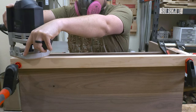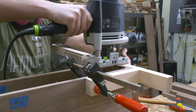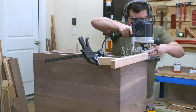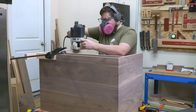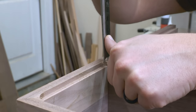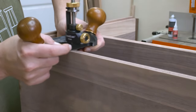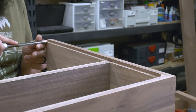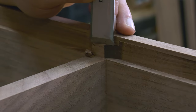I had an issue where my bit took a chunk out of my previous cut, so I ended up having to fix that. With the front of the case wrapped up I could do the same procedures to the rear — this time I only needed to take one pass because the rear gets a smaller rabbet. As with the front I had to avoid the shelf with the rear, so I used a chisel to clean up the small notch that was remaining. Then I used a router plane around the entirety of the rabbet to clean it up and make sure the depth was consistent all the way around.